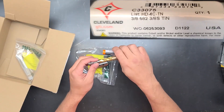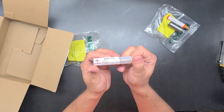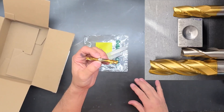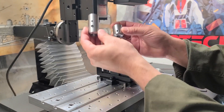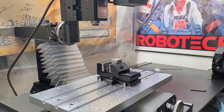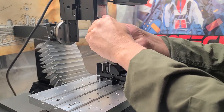I also went ahead and got myself a three-eighths inch dual-end end mill, titanium nitride coated, also made in USA. It's quite a bit bigger and heavier than the factory high-speed steel and it's going to allow me to machine the ends as well. The half-inch end mill holder is quite a bit bigger than the three-eighths, and I like that because I think it's going to provide more support for the end mill. I'll snug it up just a tiny bit with my tommy bars and get it set up.